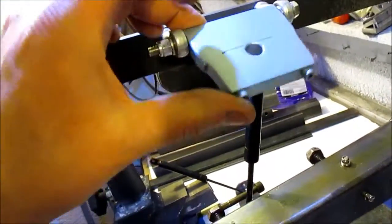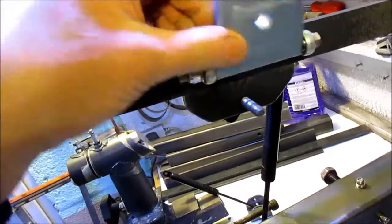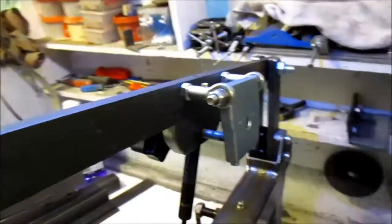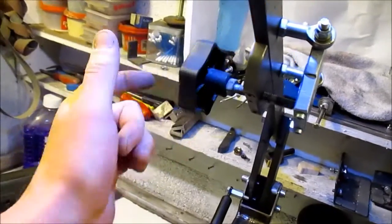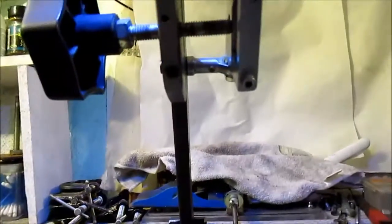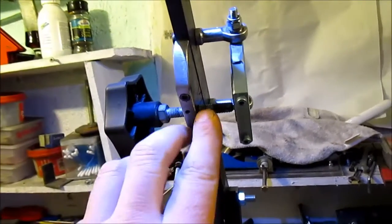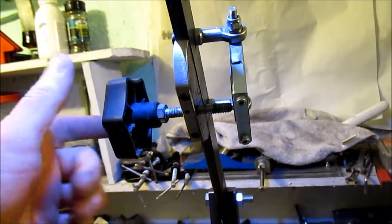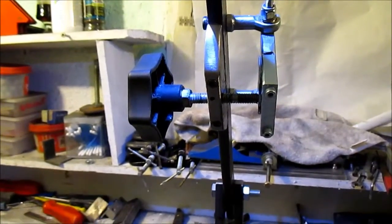This is just bar stock that I've bolted together, and I've just welded it and a piece of plate just to keep it. Probably don't need to, but I'd rather over engineer it now. I've just painted the bits that I'm happy with. See, that's the same thing, I've bolted that together. I may put a bit of weld in there, but I may stick a connector nut on there. Obviously a nice long thread. I'll see how that goes. I don't want it backing off, so a bit more thread engagement may help.